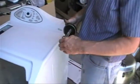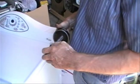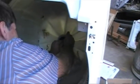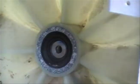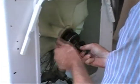This is the puller we're going to use to pull the bearings out. This is the attachment for the rear bearing — you go through the front and put the slug in. There's a piece of blue tape on here to hold it in place so you can do it one-handed. It's pretty tight going into that front bearing. Then you take the slack up and put the nut on.